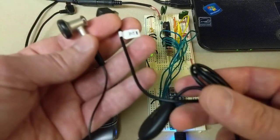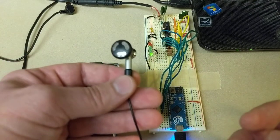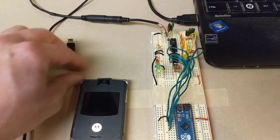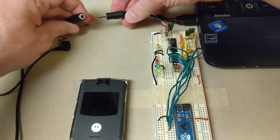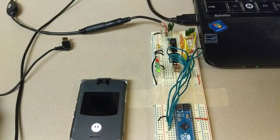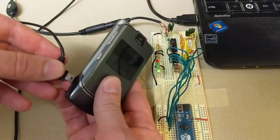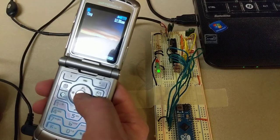What you have to do is snip the headset cable and access the wires. I've already done that on a separate headset and have it hooked up here. I made a little headphone jack adapter, which allows me to get those audio tones out of the Razr so I can send the signals to my circuit. I just plug it in here.